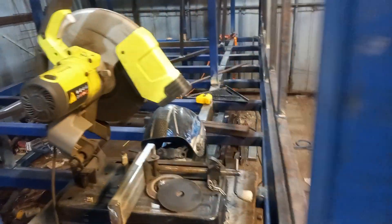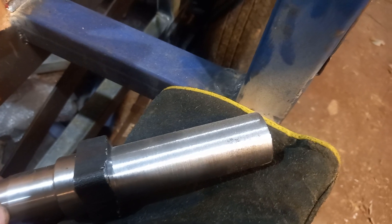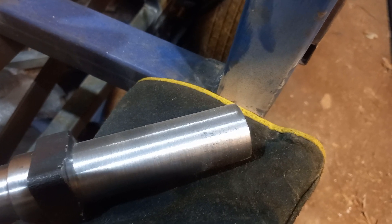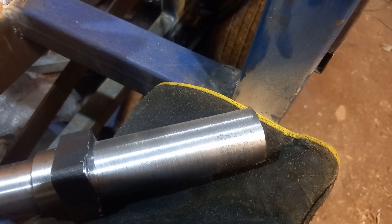Another thing that we've been playing around with is I make hollow axles just to try and reduce weight. Just buy a stub axle like so, stick it in the lathe and then machine it down to 40 mil, so it'll sit in a lump of 50 by 50 by 5 mil square hollow section. And because it's like that, the axle is actually parallel, and then I just plug weld it. That's what I've sort of done in the past. I've got two axles already made and the third one will be on there.